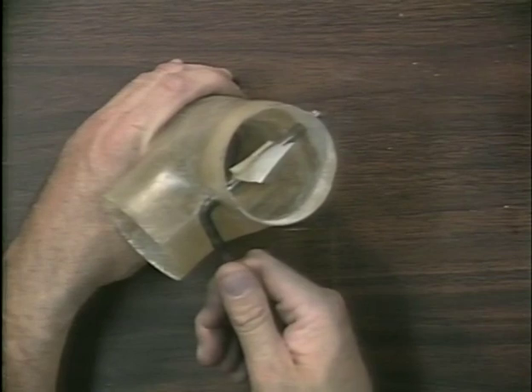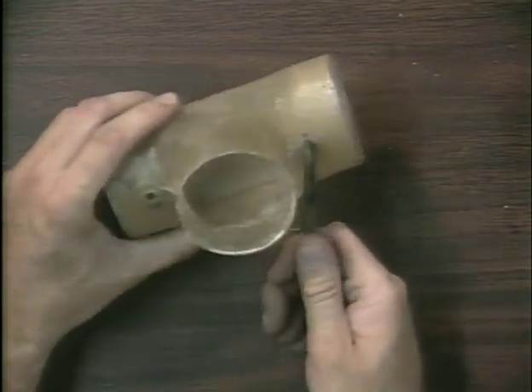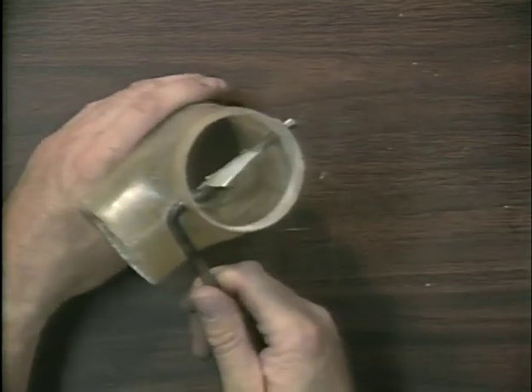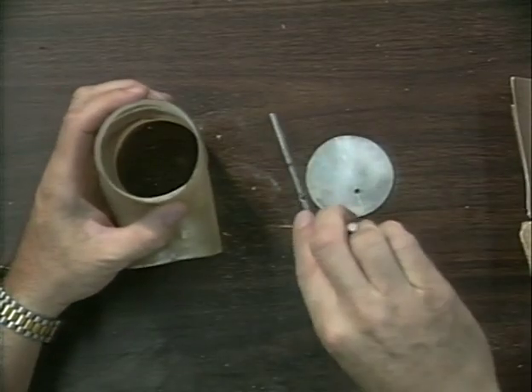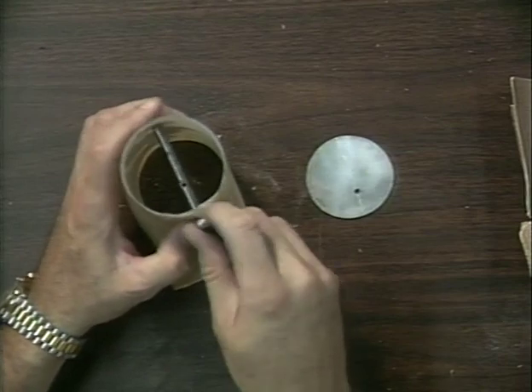Place a piece of tape on the shaft. Move the shaft to full open and full closed positions. This will verify that the butterflies will be mounted correctly before drilling the attachment holes. Remove the shaft and drill the two 1/8-inch holes three-quarters of an inch from each side of the opening. Make sure to reference the marks you made on the shaft for the correct hole position before drilling.